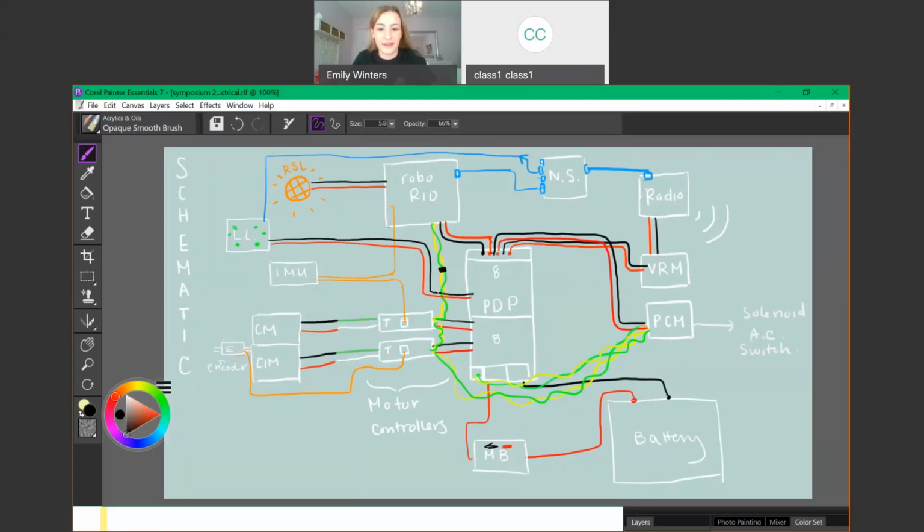And so I put it into these ports over here because these are the smaller ones. And so for this Limelight, a larger gauge wire is smaller. So these wires are too large of a gauge to go in these. These ports are too big. If you tried to put it in one of these, some of the wires or copper pieces would fall out.